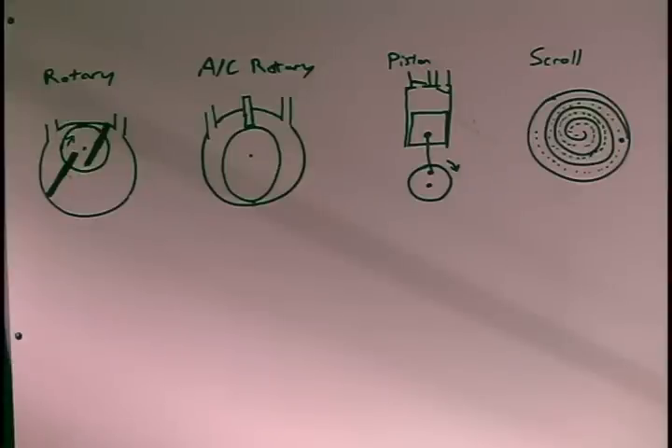The traditional vacuum pump is based off the rotary design. You have a spinning rotor with sliding vanes, spring-loaded, which keep contact with the chamber walls at all times. You have an input and an output, with the rotor spinning in one direction. As the rotor spins, the vanes keep contact with the wall and keep this capacity static. As the vanes turn, the capacity will decrease, but the amount of gas in moles won't change, so it will be compressed and pushed out the exhaust. You'll find these rotary pumps in, say, Edwards vacuum pumps or even refrigeration vacuum pumps that service technicians use.